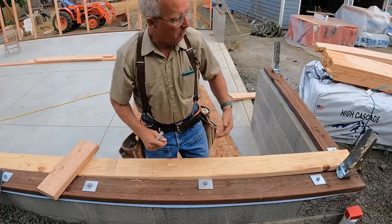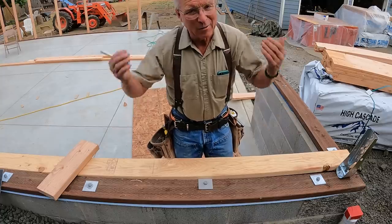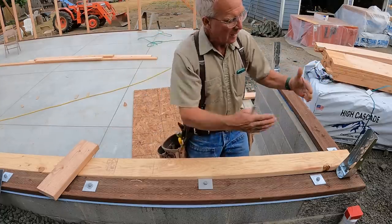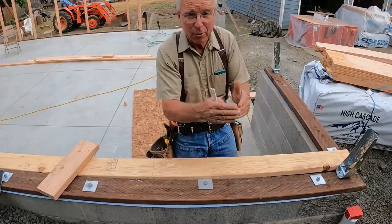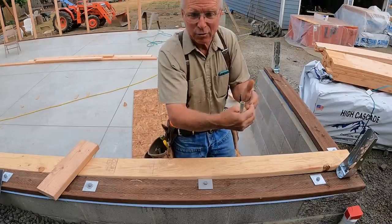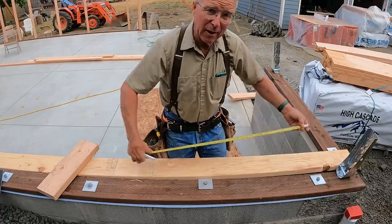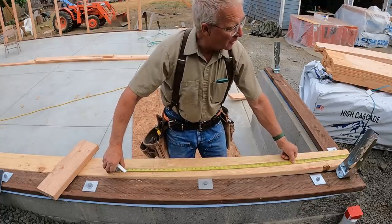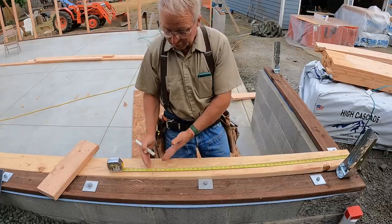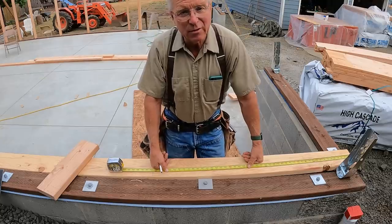Now, let me muddy the water. I'm going to put 1/2 inch sheeting on the outside of that wall. It makes no difference at all, but if you are OCD enough to want the edges of your sheets to come to a perfect 90, that is, one of the sheets runs by the thickness of the wall sheeting, then I might want to run the end of my tape down there another 1/2 inch to accommodate the thickness of the sheeting on the face of the wall. If I was going to do that, then this whole thing would transfer back another 1/2 inch. So each situation is different.